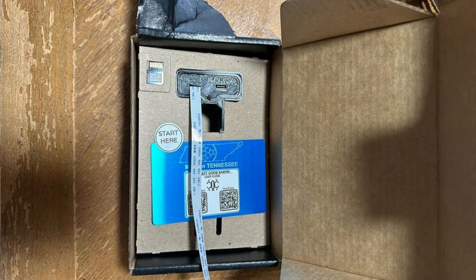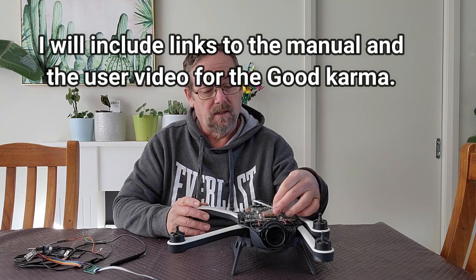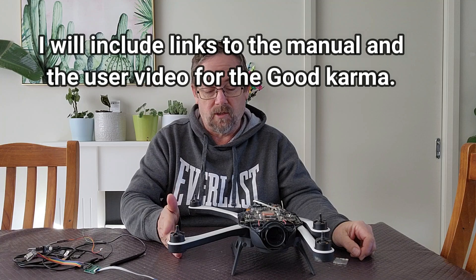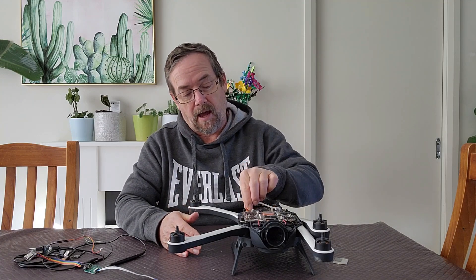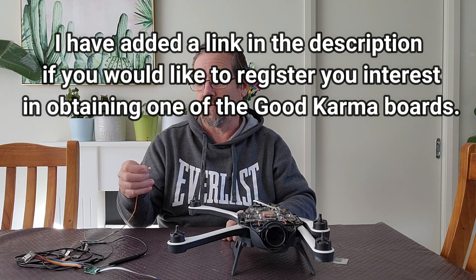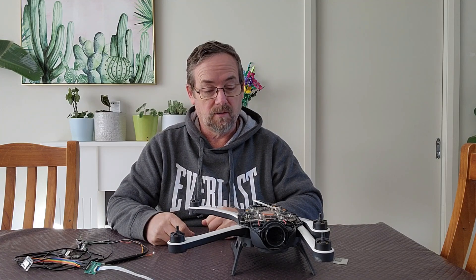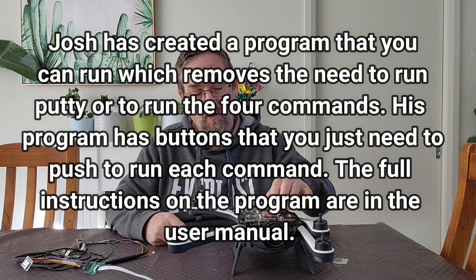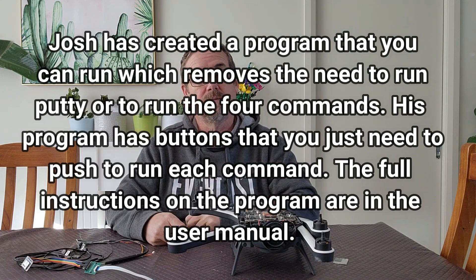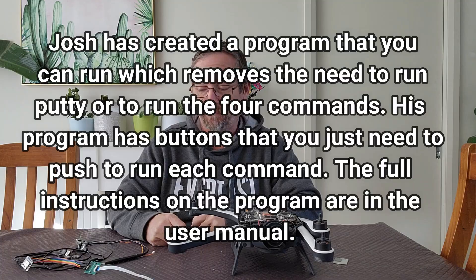The change is you go from having to build and buy all this to just buying the single unit. You don't have to mess around soldering. All you need to do is take the cover off — which is six screws, two under the battery, one under each arm — then take the can off. With his device you disconnect the cable for the arm, plug his in — it includes the little JST, I think it's 1.2 pitch — plug that in, load up Putty on your computer, and you're ready to probe at TP1. You do need to remove a little bit of underfill off TP1 like always, but there's no longer a requirement to do soldering, so this is now within the reach of a lot more people.